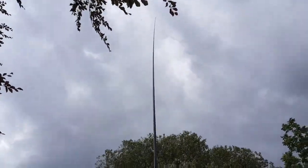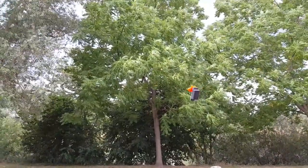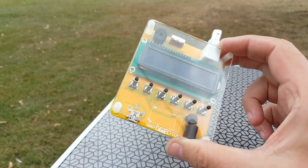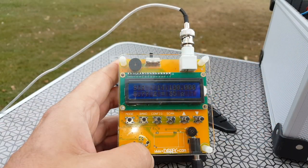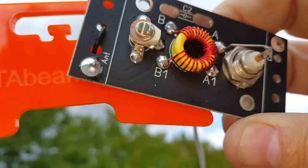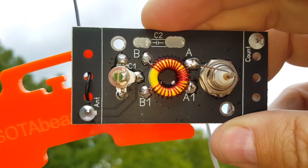As you can see, it's pretty high and my wire is coming down here with the MEF1. I'm going to use the MR100 to adjust the capacitor in the tuner — a very useful little gadget. The SWR is 5.8 to 1, so not good at all, but I want to set the frequency to 14.1 MHz because I want to use the Morse code CW portion of the band, which is the lower part. All I have to do is tune that capacitor while watching the SWR and try to bring it as low as I can.